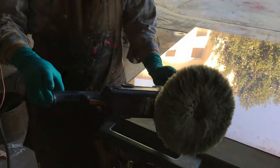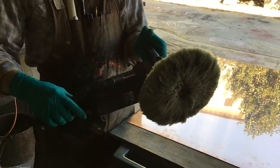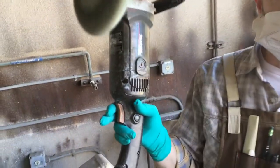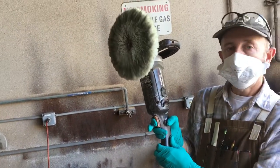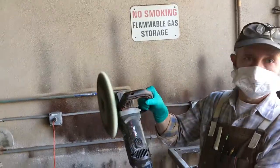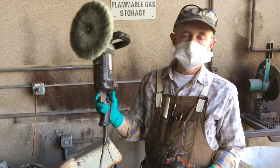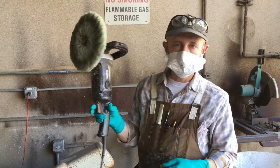Here's the tool we're going to use — the Makita sander polisher. It's a fairly basic tool. I have two things to control: the button and the trigger. I can just hold the trigger and it spins, or I can do both together and it will lock on. If I hold the button down, I release the lock by pulling on the trigger again. If you are polishing a large piece of copper it can become tiring to continuously hold the trigger, so that's why the lock becomes useful.